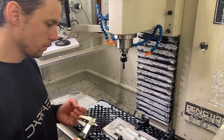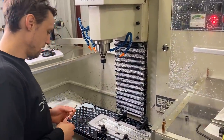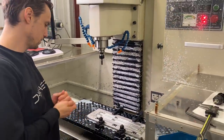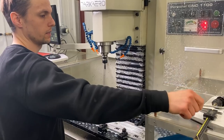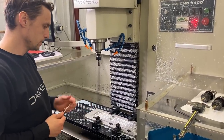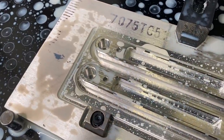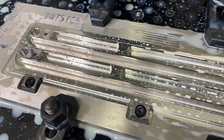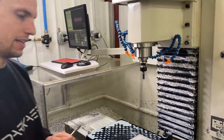I'm checking these holes to make sure they're the right diameter — they're a little bit under diameter so we need to open them up. Checking with the bore gauge and calipers. I'm going to swap out this chamfer end mill for our quarter-inch three-flute flat end mill and do another touch of the wall to open that up just a little more. We're shooting for 0.4375 inches and right now we're about two thou under, so let's see if we can get it where it needs to be.